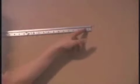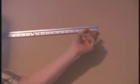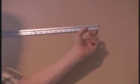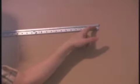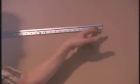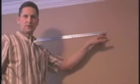Now with this short piece, the way that it lands before the big cabinet that's going to go on the end, there is no stud here. And so what I usually use is a gyprock anchor called an easy anchor. And I'll put a couple of those in. I usually put them 1 hole apart just to give it a little bit more strength.